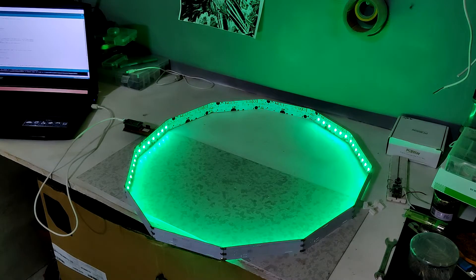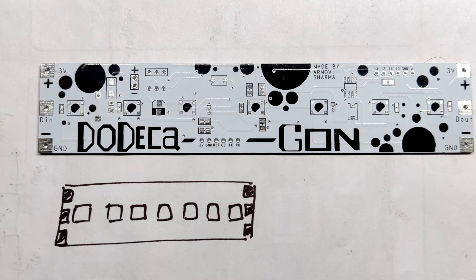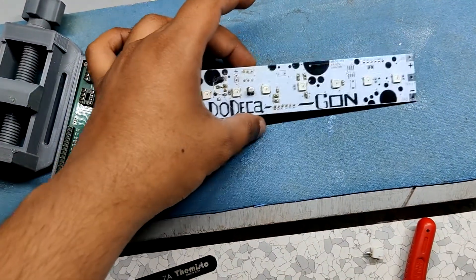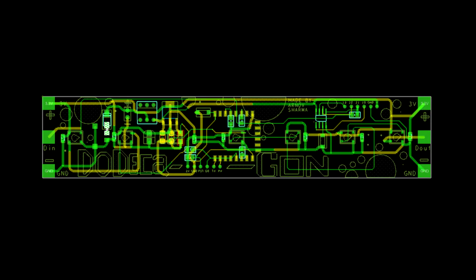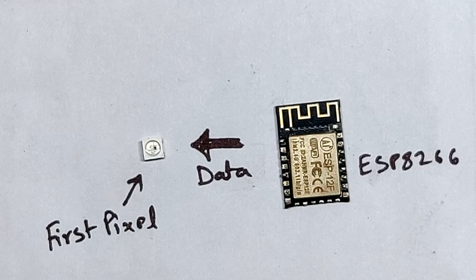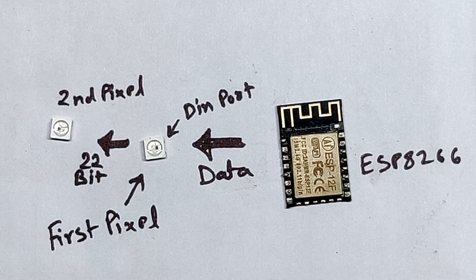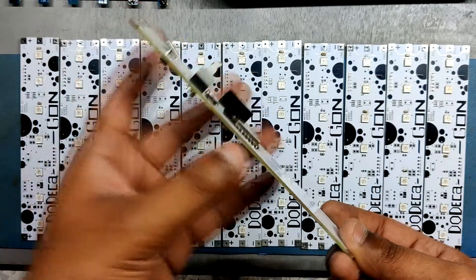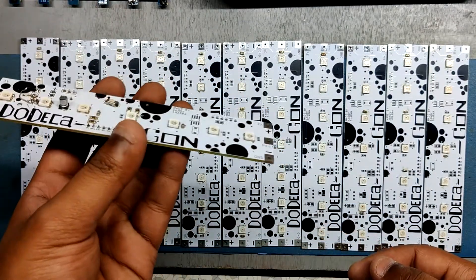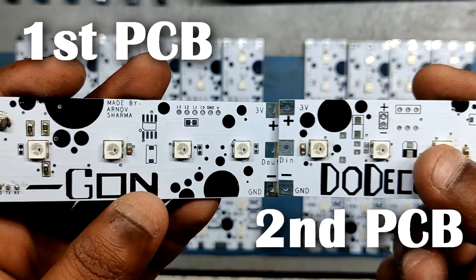This project utilizes two PCBs. One is the main board and the other is a PCB which only contains 7 WS2812B LEDs. The main board contains the ESP12F module along with 7 WS2812B LEDs. The main board generates the signal for the first WS2812B LED through the NZR communication mode. The first pixel obtains data from the ESP8266 via the DIN port and then sends the 24-bit data to the second pixel via its DOUT port. When data reaches the 7th pixel, we add another PCB which adds 7 more pixels. The data then transfers from the first PCB to the second PCB and so on.